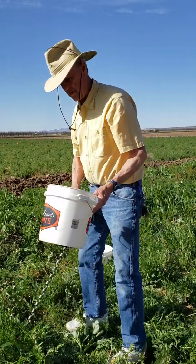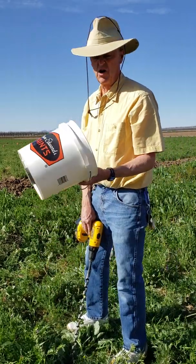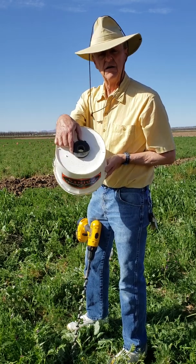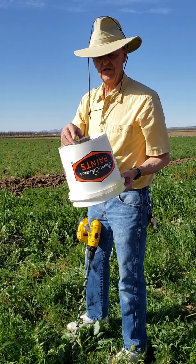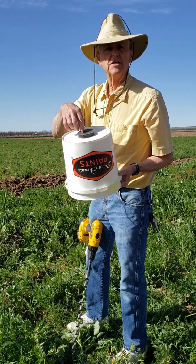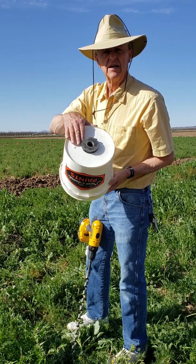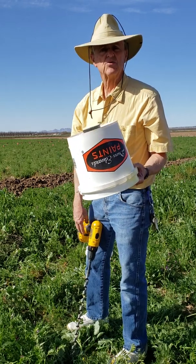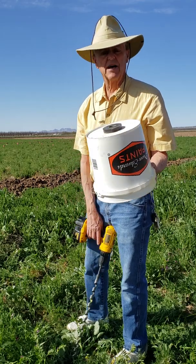On the bucket, you need just a regular small bucket with a 1-inch bulkhead fitting. What I've done on that is drill the hole for the bulkhead fitting and screwed a 1-inch nipple into the bottom and cut it flush. This allows you to push it against the ground, to protect the threads as you're drilling, and to make the hole the right size.